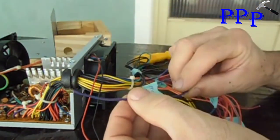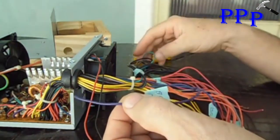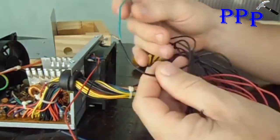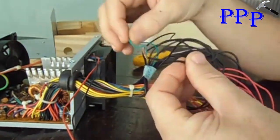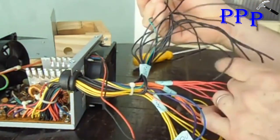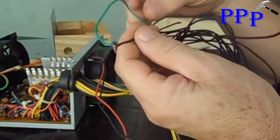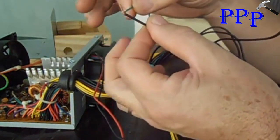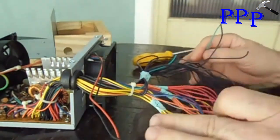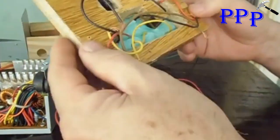The black wire is GND negative. We'll also have the blue wire which is 12 volts negative, and the purple wire which will serve for USB — we'll add that too. The green wire — we'll need to solder it together with a black wire; any black wire works as it's the negative. For the power supply to work, we must have this connection. If it's disconnected, the PSU won't function.